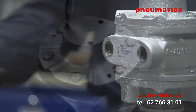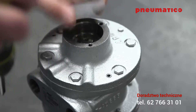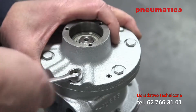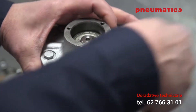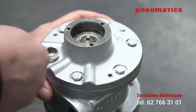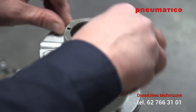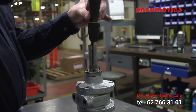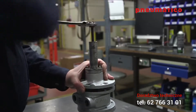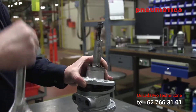First, remove the muffler and remove the end cap from the dead end plate. Remove the dead end plate bolts — use a Phillips head screwdriver for the 4AM, or a 7/16-inch socket for the 6AM. Remove the dead end plate using a puller. Remove the dowel pins from the body if necessary and replace them back into the end plate.